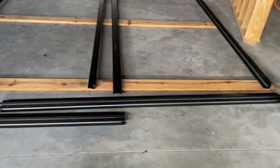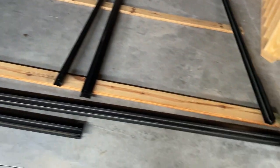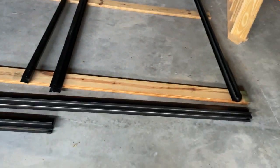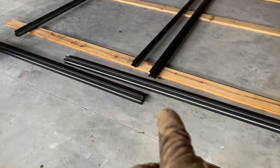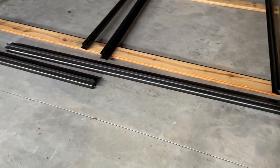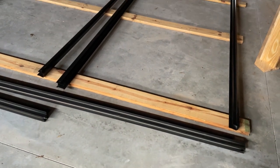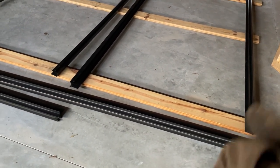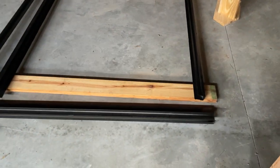We're going to have two eight-foot doors, ten foot tall, that close together. After doing the research and looking at my doors, I put an order in. Basically what I have is two bottom rails, eight foot long. These have a slot in them that the guide wheel goes into, so when you're opening and closing it keeps it secure — the wind blows and the bottom isn't flailing out from the building.